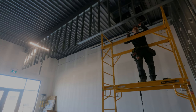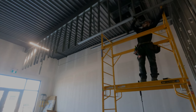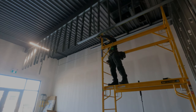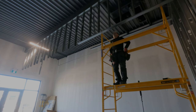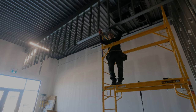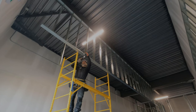You're gonna learn a lot just by watching us. I'm trying my best to teach you guys everything I can. If you don't have a level wall to go off for your centers, just use a line laser and get that first 16, or use a plumb laser — draw your 16s on the ground and then plumb them up. Get your studs plumb. As you put in your bottom track, you're also plotting out your bottom centers — your 16, 32, 48. Using that card is critical.